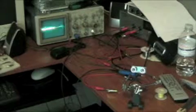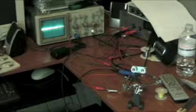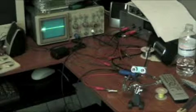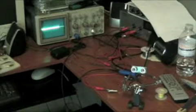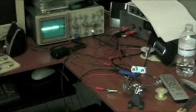It measures up to about a meter. Now here's the nice thing about it — it doesn't give you a 40 kHz signal out. It gives you 0 or 5 volts. It's got basically a monostable output. So if I breach it, it goes directly to 5 volts and stays there unless I take my hand out of the way. Let's breach the view of our ultrasonic rangefinder — keep your eye on the oscilloscope.